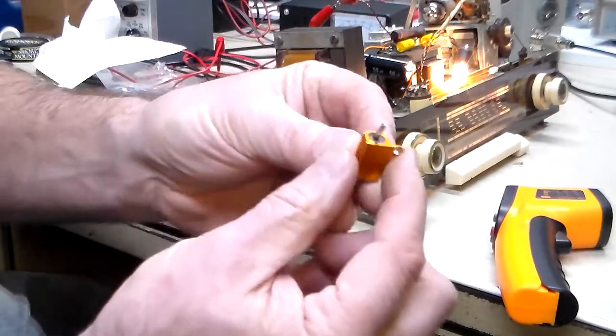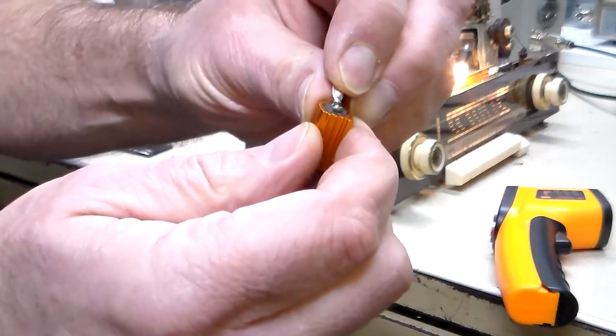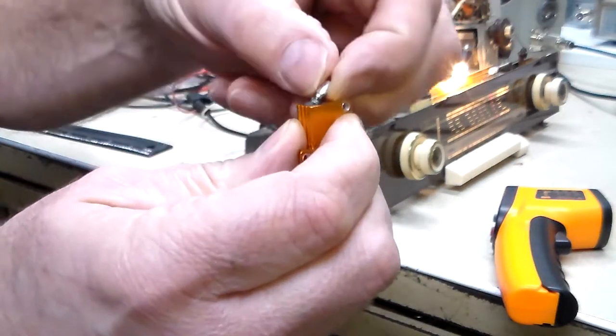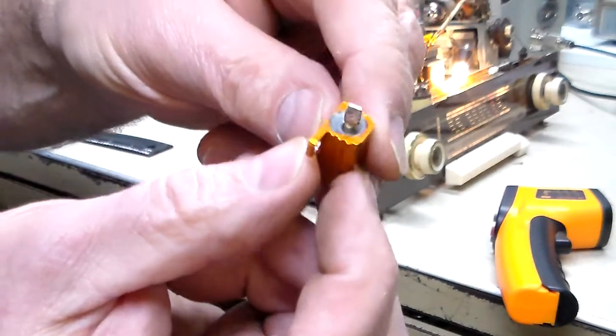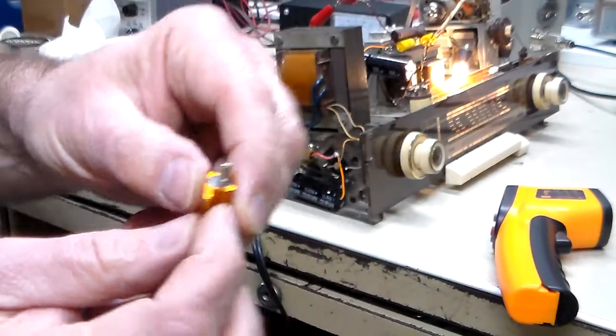This was the one I took out. As you can see, this lead is all but falling out and pretty much coming out of there. And that one really concerns me because it's almost touching the metal on the bottom — the aluminum heat sink on the bottom.